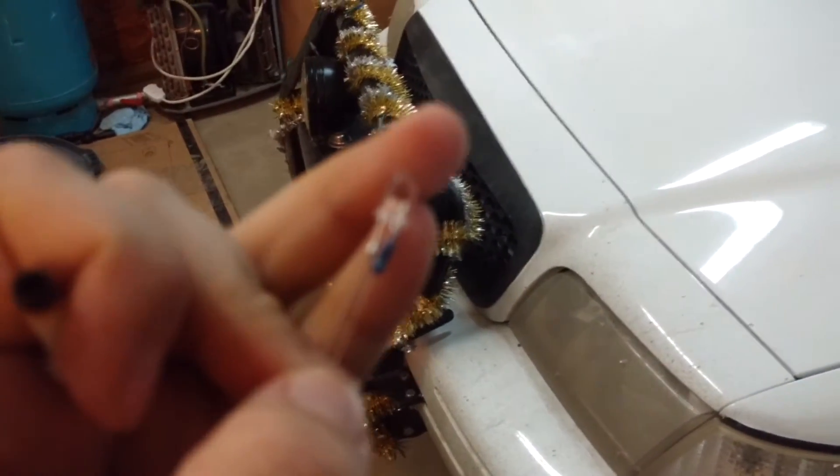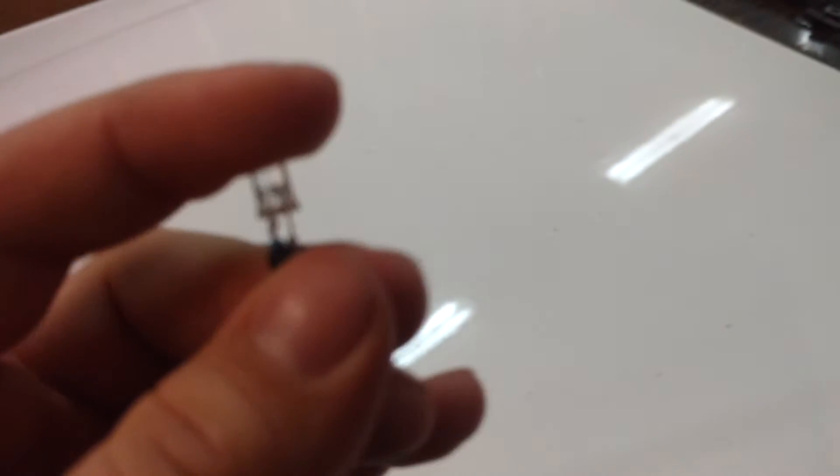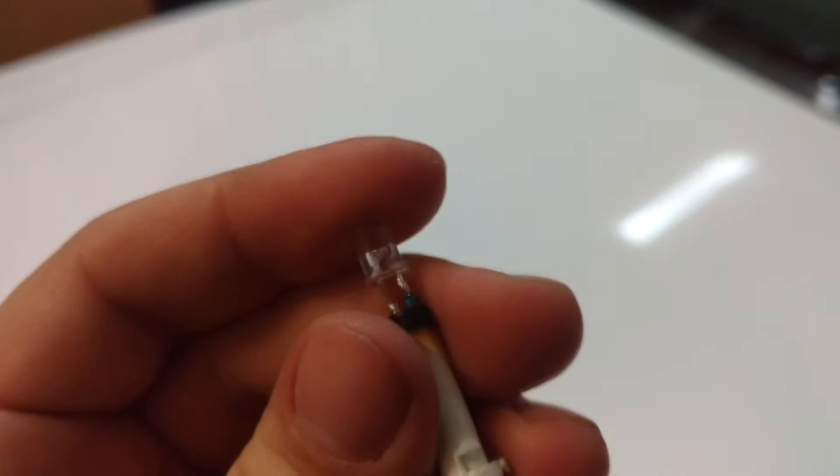I've got a 5mm white LED with a 300 ohm resistor, and that works well on the bench at least — looks good at around 14–15 volts. I'll need to drill out the little section in this housing, because if I try to insert the LED the resistor makes it sit up a little bit. Only a little bit of one wire is coming through, so I'm gonna drill that out and then mount it in at the same position.